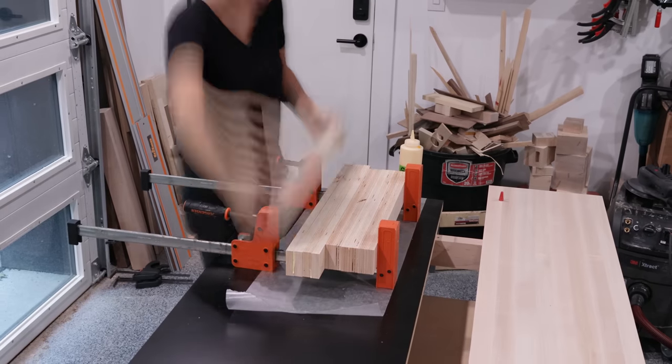The reason for the dogs down here is to support longer, heavier pieces. Like when cutting mortises for legs, I had to hold them up as I was tightening my Moxon vise and it made things less comfortable. So I just put a dog in there and now I can rest the work piece on it while I tighten up the vise. This clamping situation also works for big wide panels — rest the piece on the dog on the leg, tighten down the vise, and then add another clamp using the holes in the side of the bench. This piece is not going anywhere.